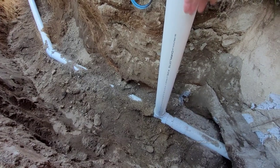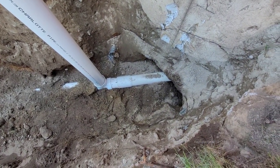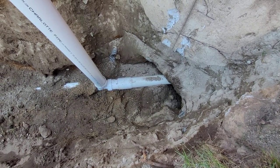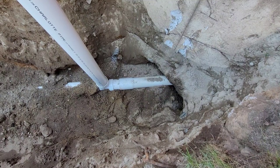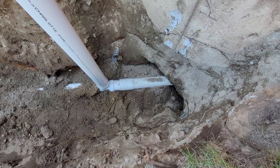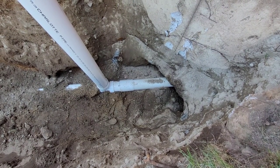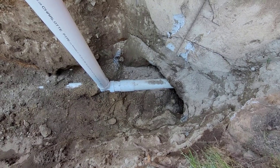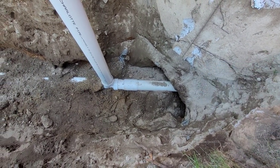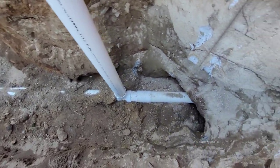And this right here is a clean out, just in case there's ever a clog, or if sediment from very low flow gets stuck in there, it can be blasted out with a garden hose. Because this sump pump turns on every 5 minutes, and every time it would release maybe 3 to 5 gallons of water. That's, I would say, a gallon a minute. That's a small trickle. This is also a pretty good pitch, too. Pretty steep pitch coming out of here, also.